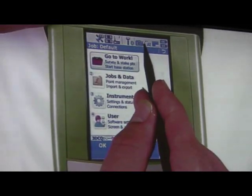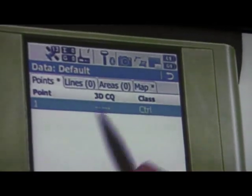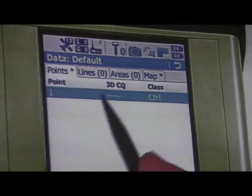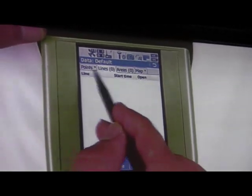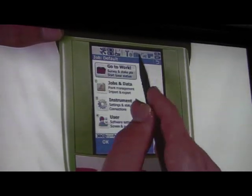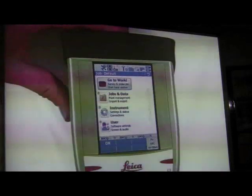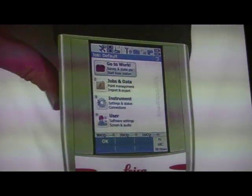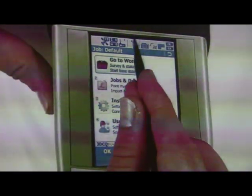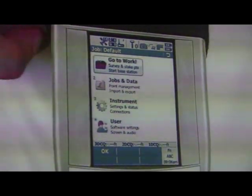You'll see a little line and square icon for lines and areas. This brings you into your point screen showing all your points, lines, areas, and your map. The next icon is a camera — there is a camera located in the data collector. Moving down the line is the GPS antenna icon, which confirms you have connection. If you do not have connection to your GPS antenna, you'll see a big yellow symbol with an exclamation point saying you're not connected.